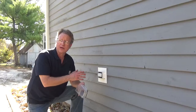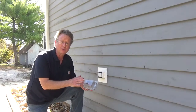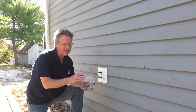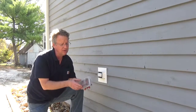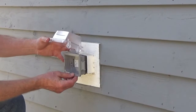When you're installing an outdoor-rated outlet or a GFCI, the new code says you have to use an in-use cover. This will allow you to plug power cords in and close the cover. I like a style like this — it has a waterproof gasket, and the cover can open in two different directions. And this just screws into the electrical box.